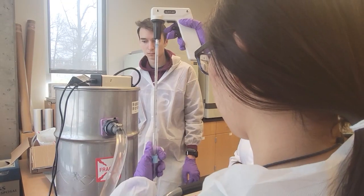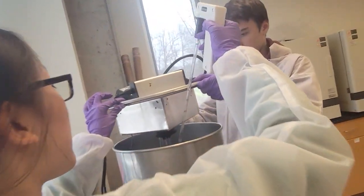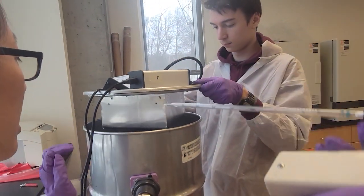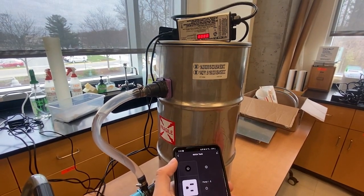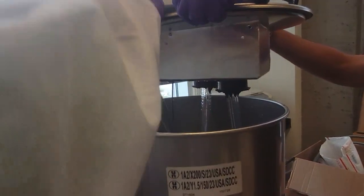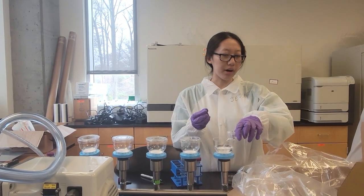We began testing by spiking 48 liters of room temperature water in the tank with E. coli to ensure the initial bacteria concentration was high enough for testing. After, the pump was run for 5 minutes so that the added E. coli was thoroughly mixed in the water sample. Following that step, water samples were obtained after 0, 1, 2.5, and 5 minutes of UVC light exposure.